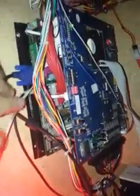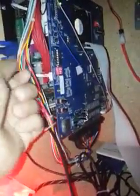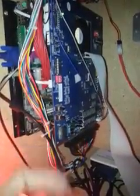So to change, this is your signal screen monitor wire. All you got to do is unplug this, move it on over, and plug it into here. And all you got to do is unplug this guy and plug it in its place. This wire is the signal that goes out to your HDMI out. So all you're doing is unplugging this so you can plug in the TV monitor. The TV monitor is just this guy. Just come around and plug it right in, boom, right where this guy's at. You just unplug this and leave it hanging here. It's zip tied up, so it won't do anything.